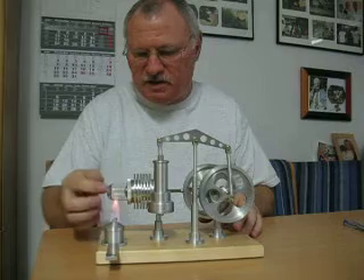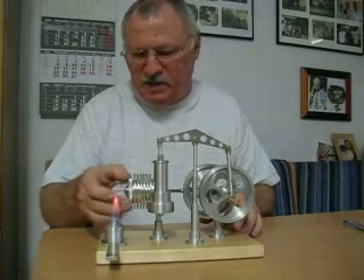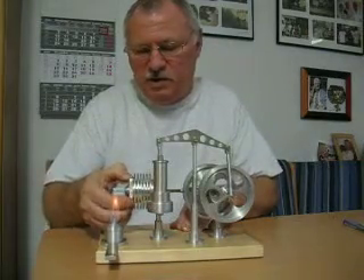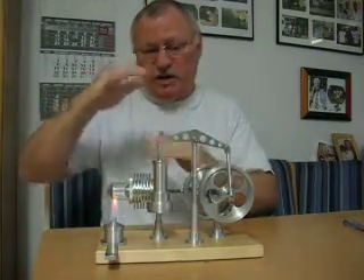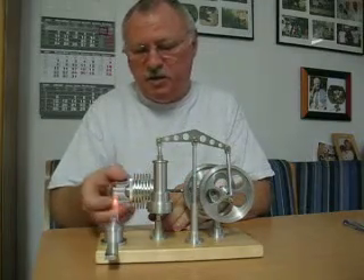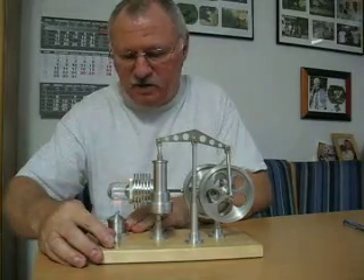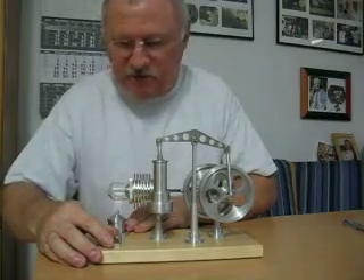As you can see, that was a slip fit, but now by tightening the nut you are squeezing the o-rings in a horizontal direction, making them grow vertically and pressing against the glass and against the aluminum, making a perfect seal. As long as you don't get any fat or oil on the o-rings, this seal should work perfectly.